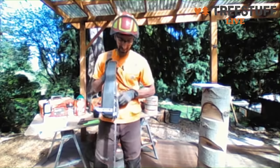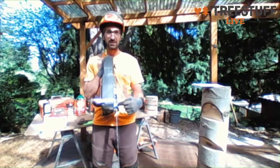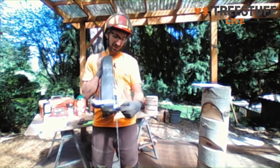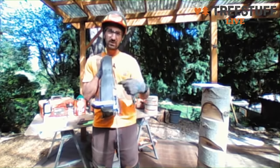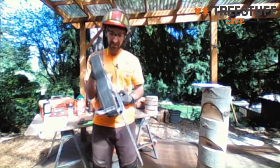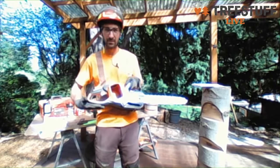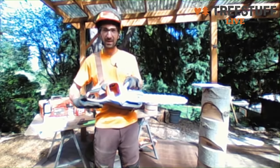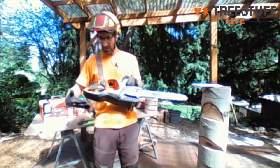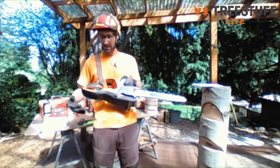Second safety feature on the back of the saw is the chain catch pin or chain catcher. This needs to be in place. If you throw a chain, or I should say when you throw a chain, because we've all done it, this catches that chain and stops its movement and prevents it from swinging back and hitting you. Related to that is the hand guard here in the back of the saw, this wider portion on the bottom of the handle. If and when that chain would get thrown, it's caught in the catch pin and it'll swing back and it may hit the bottom of the saw. So making sure that that hand guard part of the handle is intact, it's not broken, protects your hand when you're operating the saw.